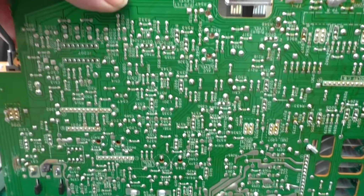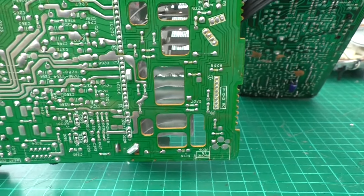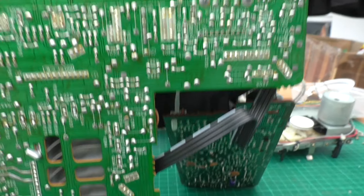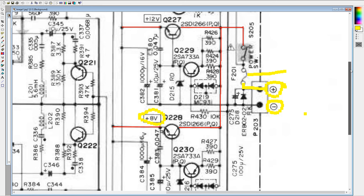I can't see anything obvious at the moment, but I've got to do a full cleaning and probe around with the meter to find out the actual fault. From the terminals I'll put the crocodile connectors positive and negative, trace that through up to the fuse - fuse blown. Obviously replace the fuse, then check the power switch, then trace it through to Q227 and Q228. Twelve volts was on one side but no eight volts on the output.